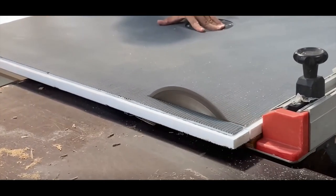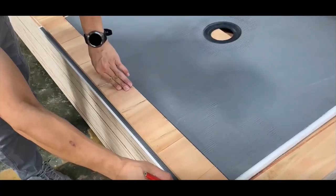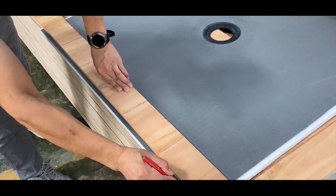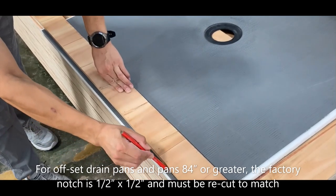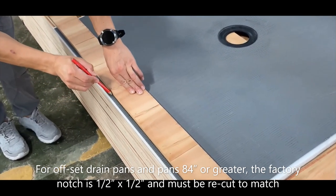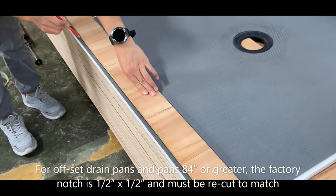Measure the length of the shower space and subtract from the length of the pan. Divide that number by 2 and cut that amount from each side of the pan. Recut the factory notch 1/4 inch deep and 1/2 inch wide on any cut edges. The notch must be recut on any side where it is trimmed away in order to ensure a proper seal